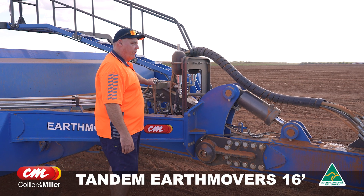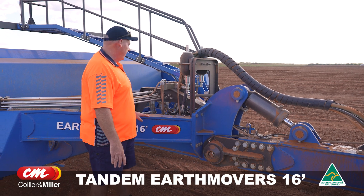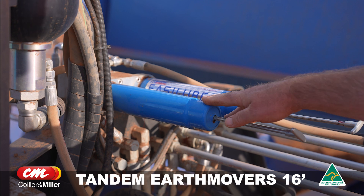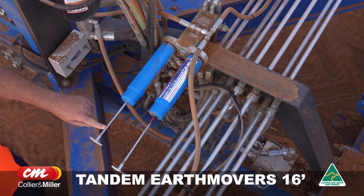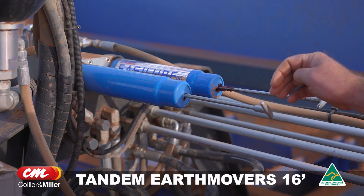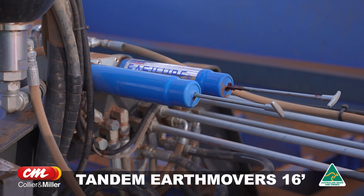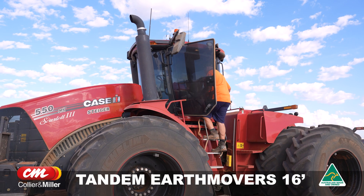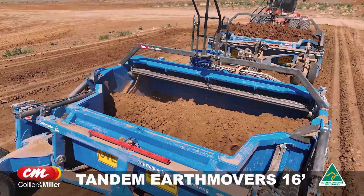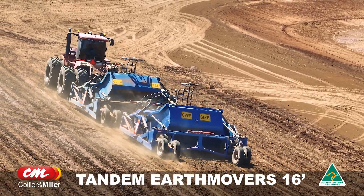The Hayden Auto Greaser we have — basically everything on the bucket is greased. The way we've set it up, we've put a downforce valve inline. The grease cartridge is here and we've run canister type — it's just easy for manhandling. The operators basically leave the tubes out; when the runners run back in you know the tubes are empty, you jump out, change a new set of tubes over and straight back into it. We're getting more productivity out of the machinery having auto greasers on everything, not having to stop every two hours as recommended to grease points.